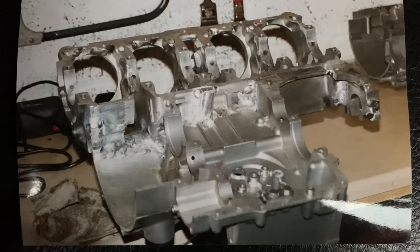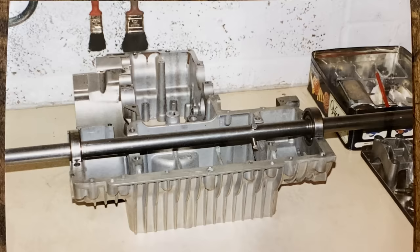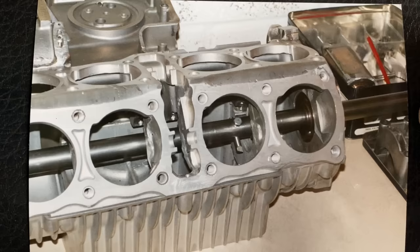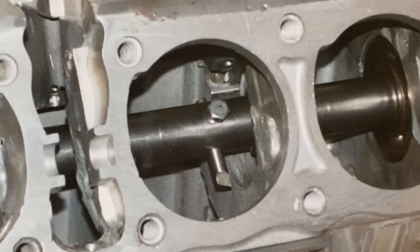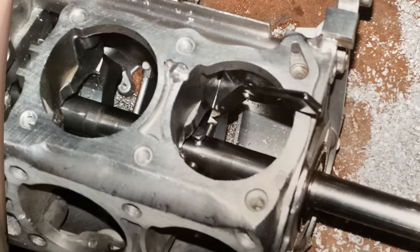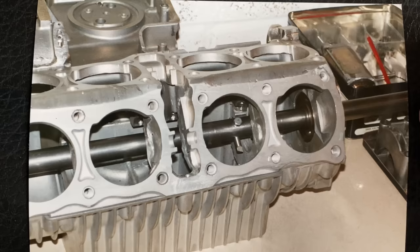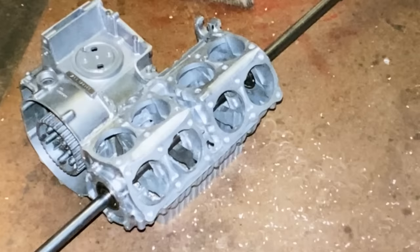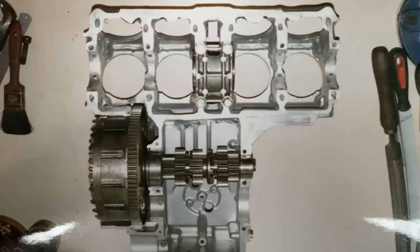The next thing I need to do is machine the areas where the bearings sit for the crankshaft. And in this picture you can see why I had to redirect the oil gallery on the underside of the upper crankcase. To bore the inner main bearing journals I just use a piece of steel with a cutter and slide it in and out of the two existing outer bearings, which I will hand scrape to fit perfect first. With the crankcases bolted up tight together and the two outer bearings in place, I can put on a cut by using a feeler gauge against the bottom surface of the bearing to put on a cut for the upper part which has got weld on it. Then you progress in and out with the tool taking off metal a little tiny bit at a time until the cutter just marks the bottom crankcase surface — then you know you're absolutely perfect.